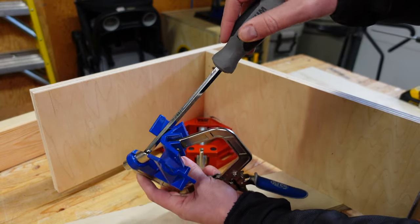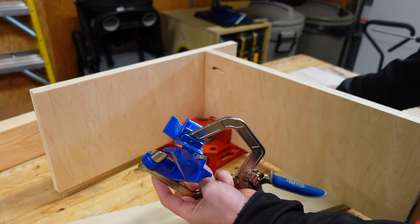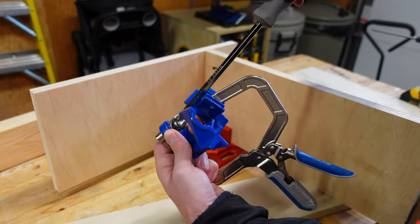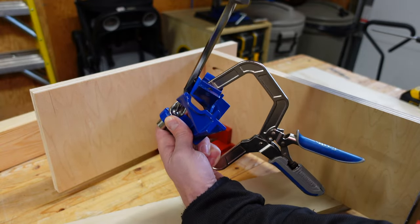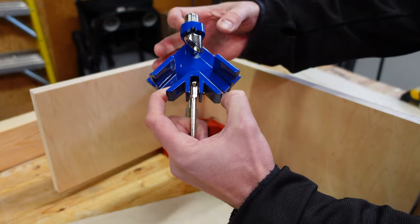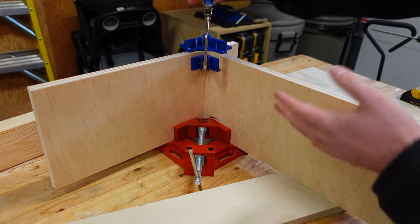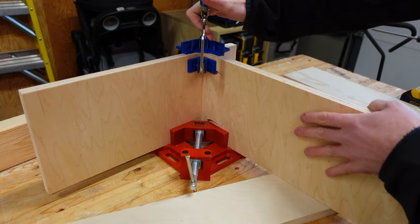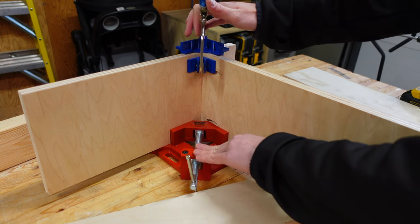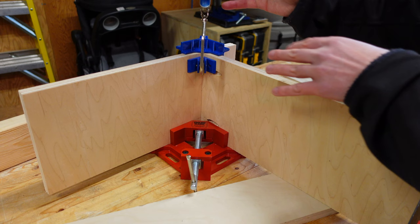To get the Kreg to work for the T-joint, we just have to loosen this screw here. This took a little testing because I was always fully removing the screw and had a heck of a time putting it back in each time. If you just loosen it enough, you can pull this out and rotate it 180 degrees, push it back in, and screw it back down. Then we can essentially take our clamp — and you can see it now looks like one of those older-style 90-degree clamps — slide it over our piece and clamp it down. This is really that use case I have all the time, when putting together bookshelves or needing to put a shelf on a step-back cupboard. These two clamps do a great job at allowing it to be mounted securely to the workbench while also having the portability to move between different components with the Kreg.